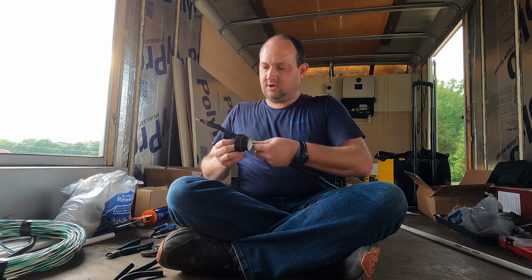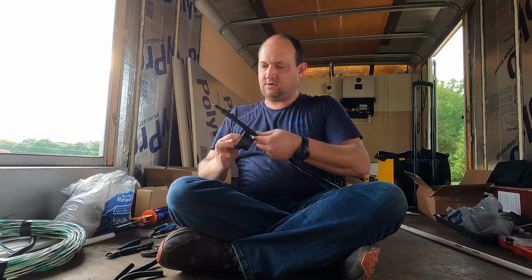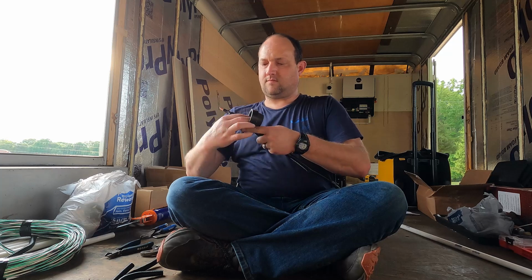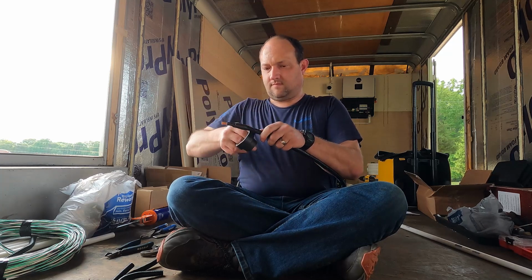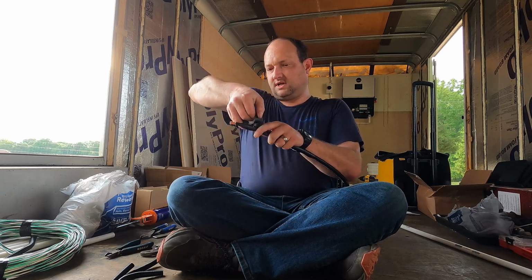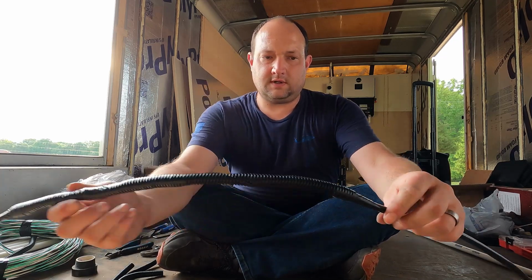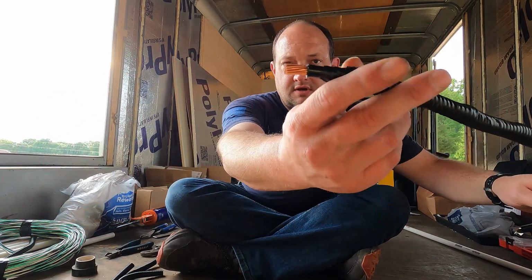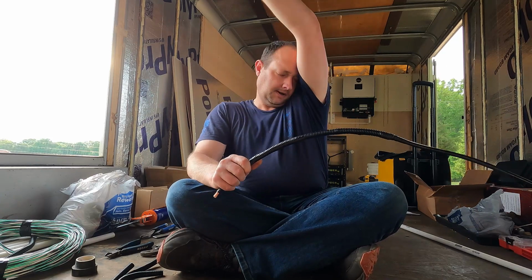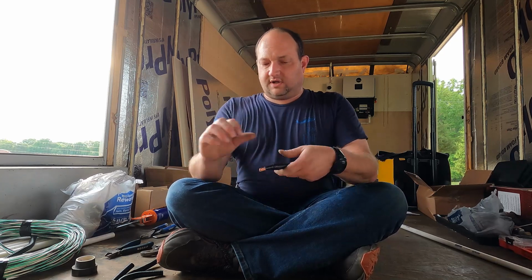And this is really what's going to protect that wire in the back where those sharp edges are. Come up over that other tape just a little. So yeah, as you can see, I got it secured here. I secured it here. And then I started in the center about right here, and I run it all the way up to here, because that's where that 90 is going to be in the back. And that stuff could pop out, because it's just plastic tubing with a split down one side, so it's easy to get your wire and stuff in.